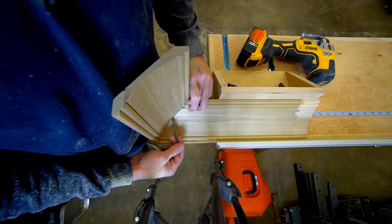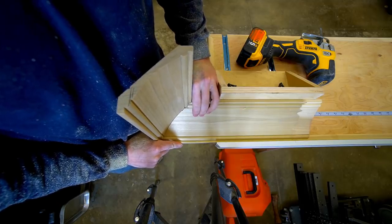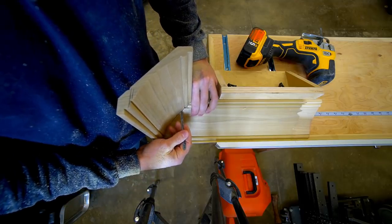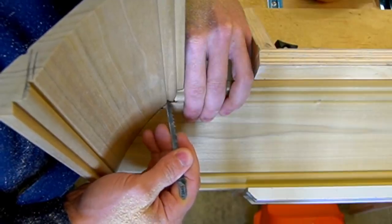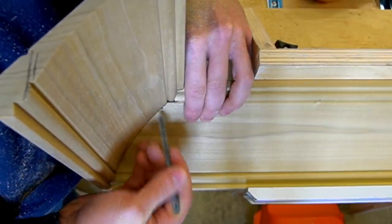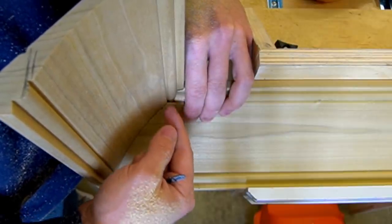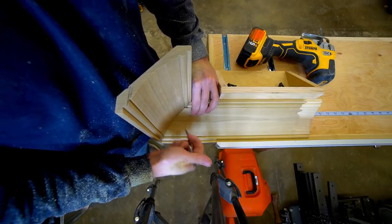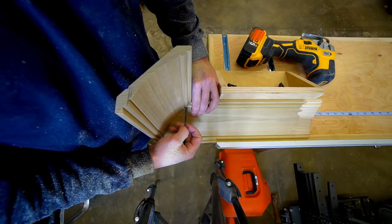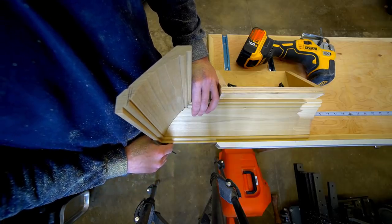As you can see, in order to get this tight — and I realize this is a far cry from a pretty cope joint — I had to remove this whole area of that bead, and you can see how ugly that is. In an extreme situation, if I had to cope into this for some obscure reason, I could probably caulk that and make it look okay. But that's certainly not what you would want to do for a whole house.